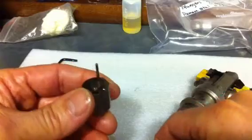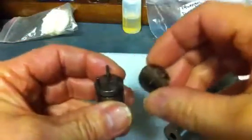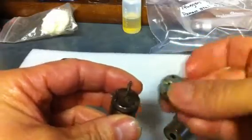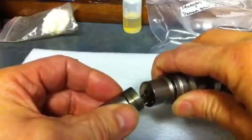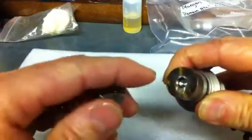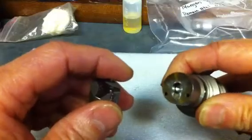To put this back together again, you just align the pins up, put it on like so, and make sure the pins go in the hole. Put this one back on with the ball bearing in the right place — don't flip it upside down the wrong way. This would then sit right on top of the injector core, and inside of here you can see the plunger. This plunger is set back — this is a modified injector basically set to give 178 cc's of fuel per thousand stroke.